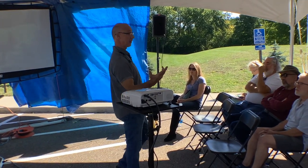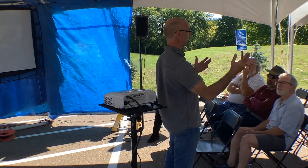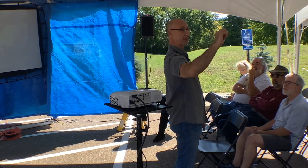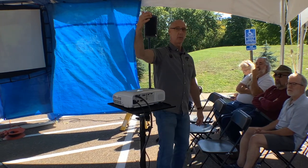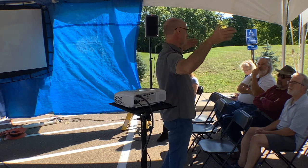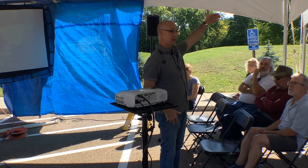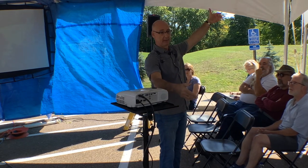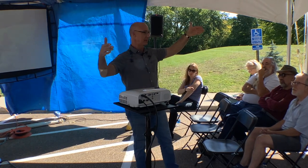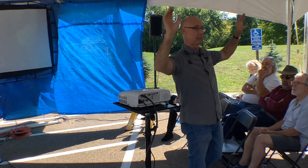So I use space balls as the product I use for this. Space balls are just little foam, quarter-inch diameter rubber balls. And what we want is the panel to have the opportunity to expand and contract within the frame. Where we live, seasonally, high humidity in the summer, stupid dry in the winter. So we can't not allow wood to expand and contract. It's going to do it. If you try to stop it, something's going to split or check or blow up.